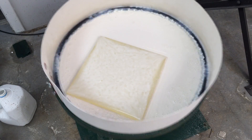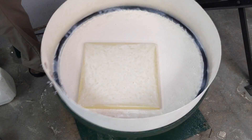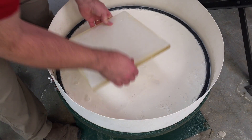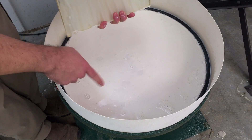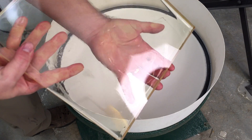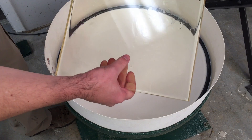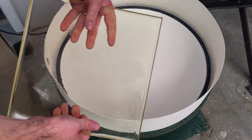Our Reciprolap has been running about eight hours now with the cerium oxide. When you're using a felt pad and cerium in your Reciprolap, you really want to pay a lot of attention to it — you don't want it to dry out and have your piece get stuck to the felt pad underneath, as it can be very, very difficult to remove. So babysit it a little bit more when polishing to make sure it doesn't get dry. Now after about eight hours, that is an absolutely spectacular polish — super tight, nice edges, very, very flat, and a beautiful polish on this piece. That's the power of a Reciprolap.